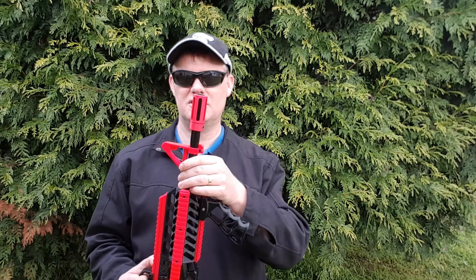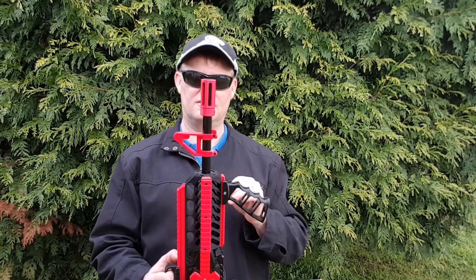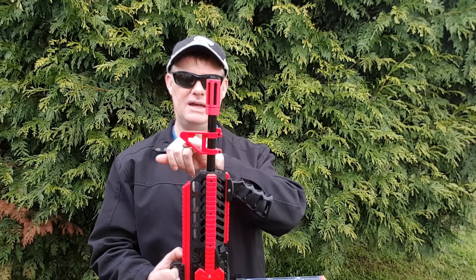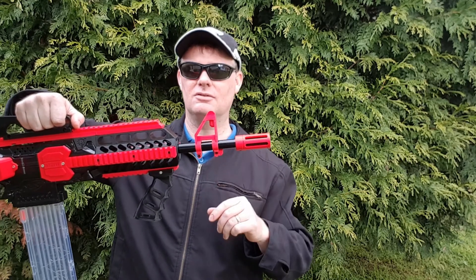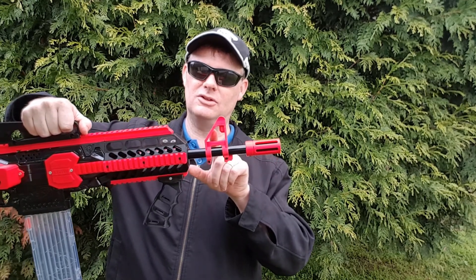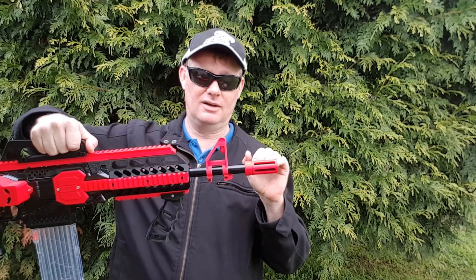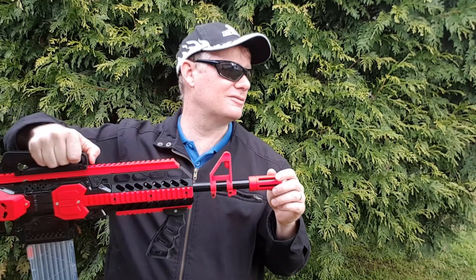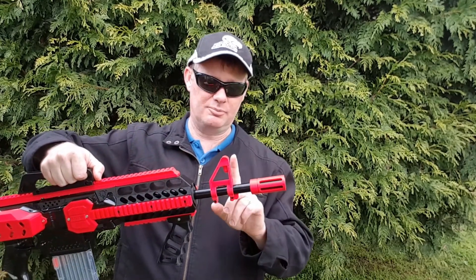There's this part here. I ended up printing it a few times and redesigning it. I originally printed it like this, but the curling that happens looked really bad. I then went to print it like this, which means you need to use supports - but that meant the curling happened in a non-noticeable place, which was good. If you don't have curling problems, printing it in ABS would probably be fine. So print that with supports this way.